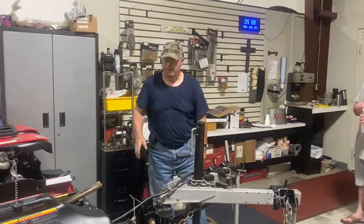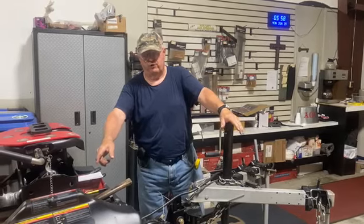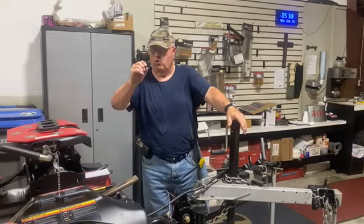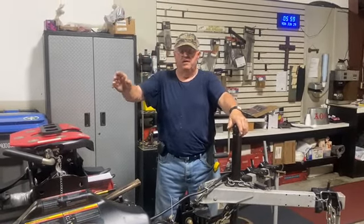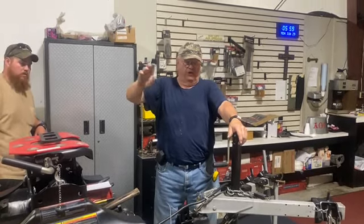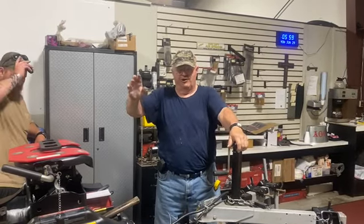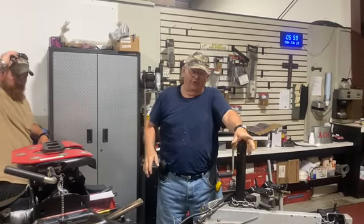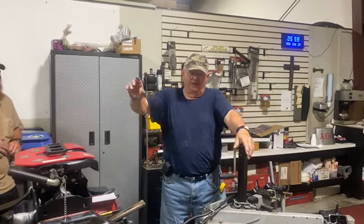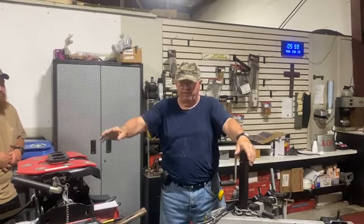The other guy I deal with here says the back always has to go down. If I'm pulling a 24-foot trailer, the back may only go down a quarter inch, and the front, nothing. 26, 28, the back goes down 3/8 inch, front, nothing. 32, 34, the back goes down 3/4, the front, nothing. 36, 38, 32-foot toy hauler, the back goes down 1.5 inches, the front goes up a little, down a little.